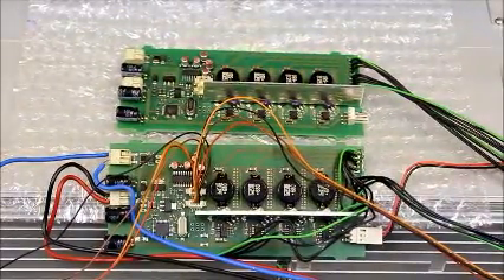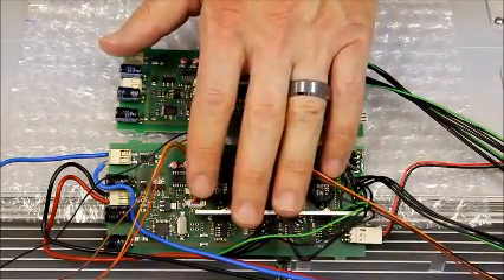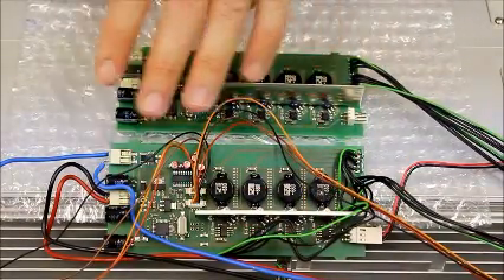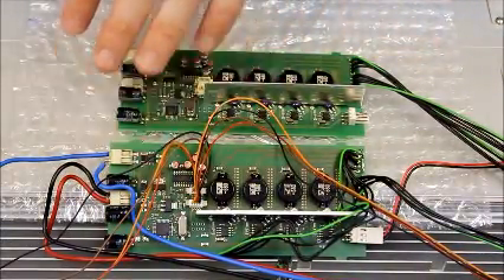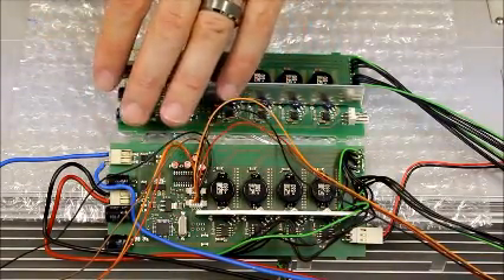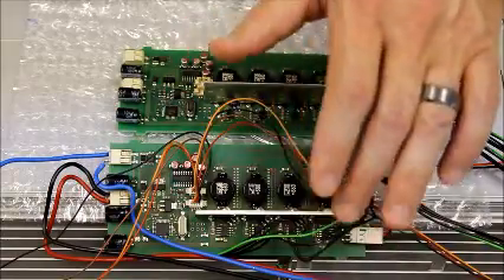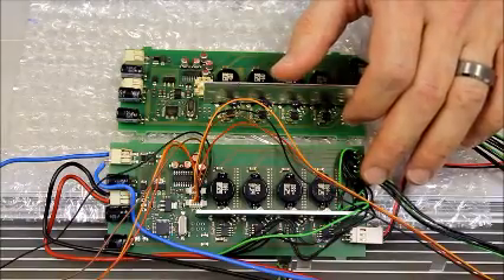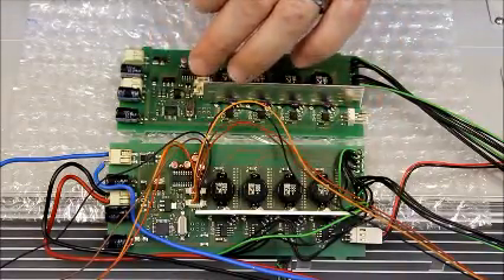Next step is to swap the wires from the current KSQ to the new KSQ. I've flipped the original KSQ over so we can get a better look, and I've laid bubble wrap down on the fixture to give us a clean working surface. What you want to do is remove one wire at a time and move it from the original KSQ to the new KSQ. We recommend starting with the blue wires — top blue first, then second blue, then black, then red. Then go to the other side and do your black and red connector top, then black and red connector lower, and also move your fan wire over. Finally, the two connectors in the middle — do the top one first, then the second.